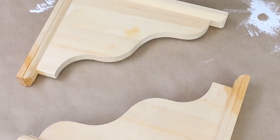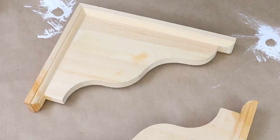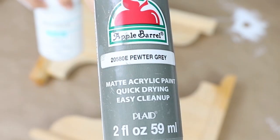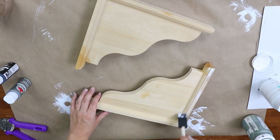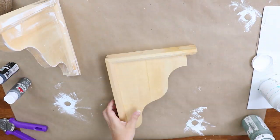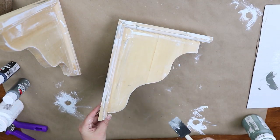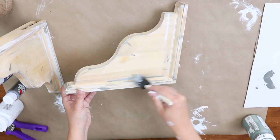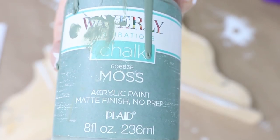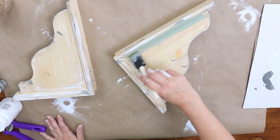Since these were raw wood, I wanted to add some colors underneath so that when I sanded them, I'd have different colors coming through. I took some white and gray acrylic paint and loosely put that paint in the areas I'd later sand. Then I added one coat of Moss by Waverly to all of the corbels, making sure to get the back side because you will be able to see them when they're sitting out.